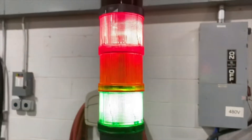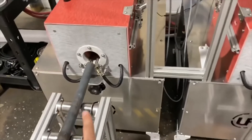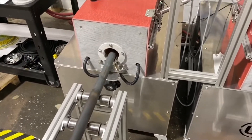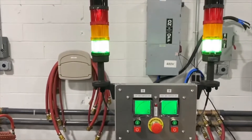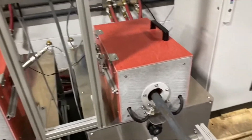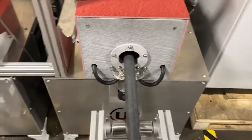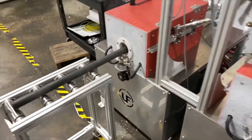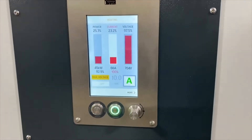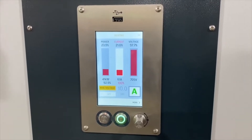I will press the on-off switch and enable the heating operation. Now, as soon as the rod is inserted, the proximity sensor will recognize it and the power supply will start the heating cycle. We're also pre-inserting the second rod, which will be heated once heating of the first one is finished. Right here you can see the power output and the amount of power delivered to the rod.